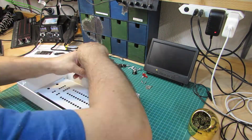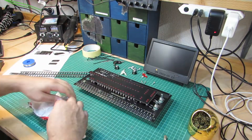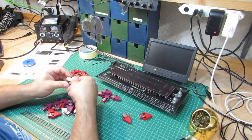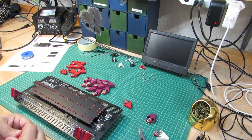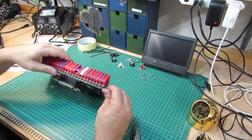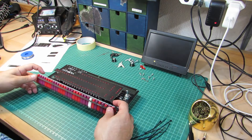The next step is to mount the front bezel to the outer frame, after which we mount the switches. The switches come with a mounting bracket which must be broken into two halves. I group all similar switches together — there are red and purple ones, momentary and latching ones. Then I insert the leftmost switch and slide in one of the two alignment rails before putting the other switches into place. This was the most cumbersome part of the assembly, but the two alignment rails and the included zip ties definitely helped.